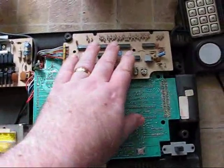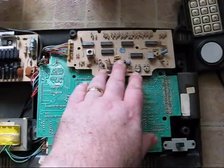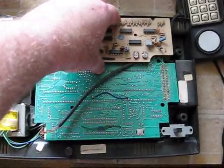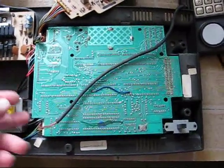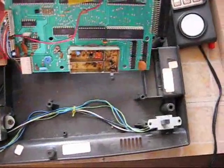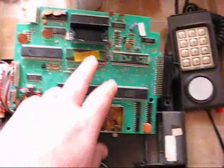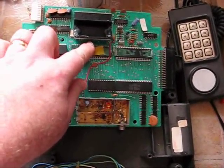The brown board is to do with the video output — to generate the signal to go into the RF. Down at the bottom we have the main motherboard. As I mentioned, this is actually a damaged board. What I had to do was salvage a chip that wasn't working on something else and put this in.